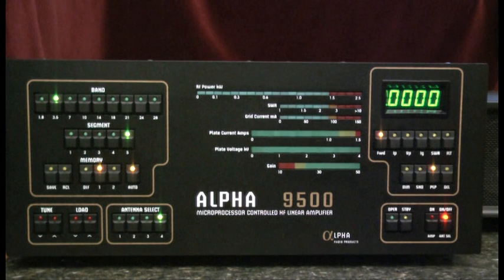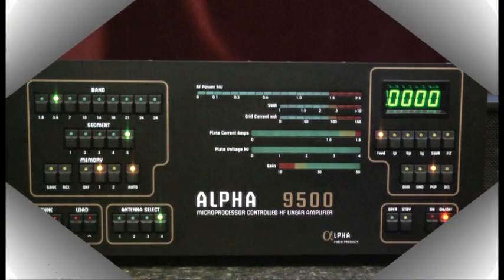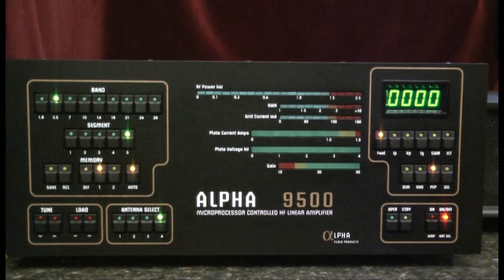You'll need to be mindful of where you place the power outlet so that the cord to the amplifier can be kept at a minimal length. You'll also need to consider the type of power plug used at the end of your power cord, and of course this will depend on the current rating of your circuit and local codes and ordinances.